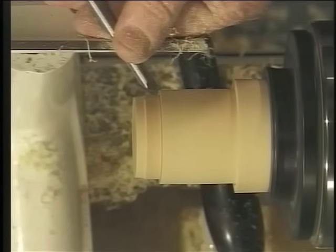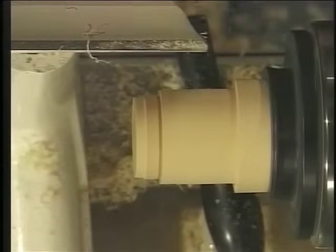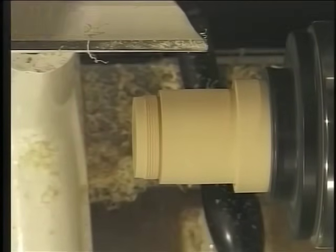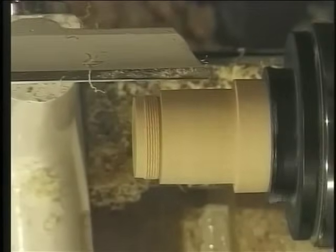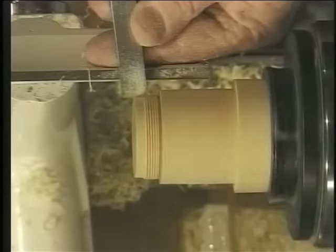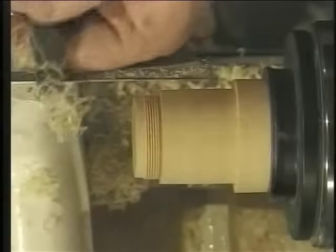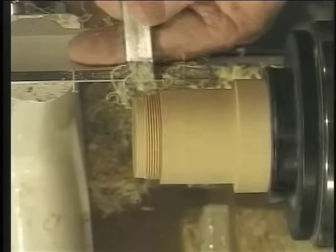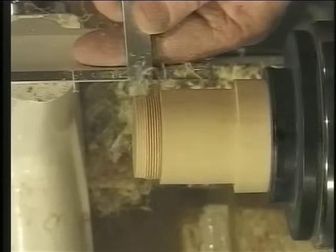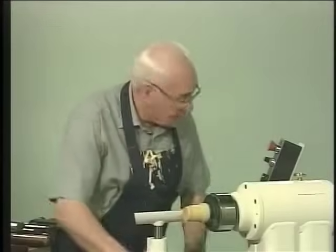Reintroduce the groove at the back, so the chaser has time to remove from the surface of the work before it does any damage. Back to chasing speed, 300 RPM, and we'll recut the thread again. Again, nice clean shavings coming off from the chasing tool, which indicates it's sharp. We can see the witness mark appearing now on the surface of the wood. There, good witness mark. So hopefully our thread should fit.